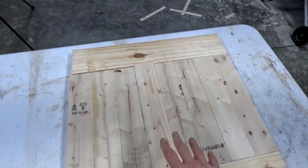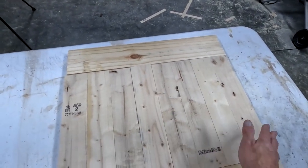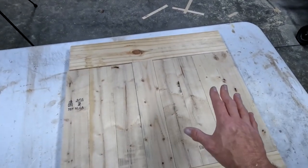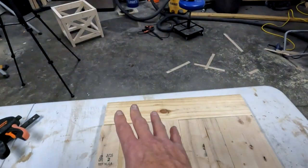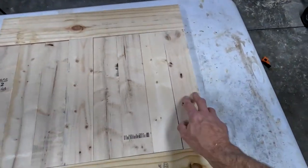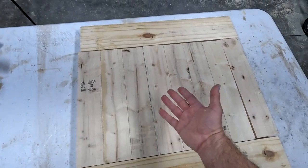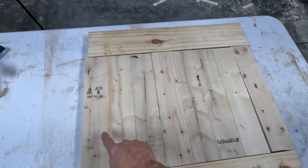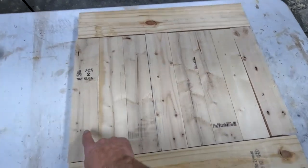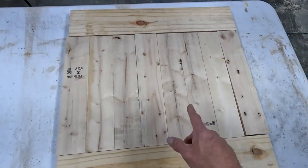You've got to decide what kind of finish to do for the top. If you want a distress finish — take a hammer and nails, beat the crap out of it, and stain it — you can just clamp together, sand a little, and go. I'm going to run mine through a planer for a nice flat smooth finish. I'll stain the top and paint the bottom for a distressed look. Before that, pick your boards, flip them, look at tops and bottoms, and put your bad side whichever way you want. I prefer my bad side up so when I mark pocket screw lines I'm not putting screws on the wrong side. Mark the boards, glue them, clamp them, screw them, and move on.